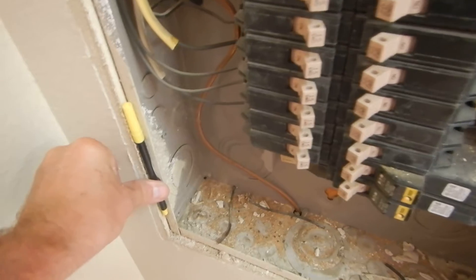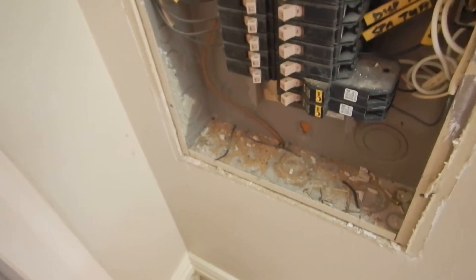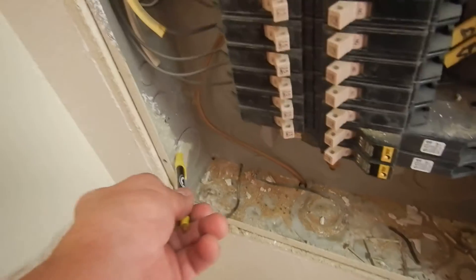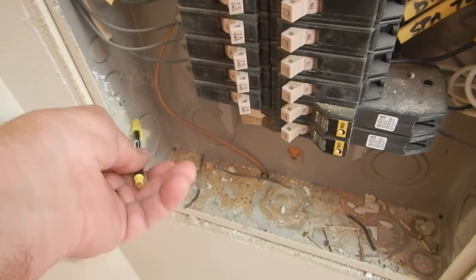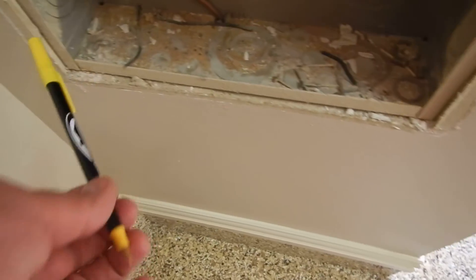The cabinet cover is not supposed to have more than an eighth-of-an-inch gap. Debris is not supposed to be inside the cabinet, nor is paint. I'm not seeing any paint on the bus, so you probably never have any ill effect from the paint, but the code says no paint and no debris inside the cabinet.